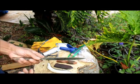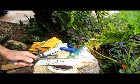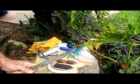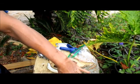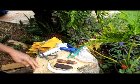I freehanded it, so I did use a caliper and measured the thickness and the length of the bevel, and then you can use a tangent calculation to figure out the angle, or you can see how much offset I got from the stone. And this video could be long and boring.